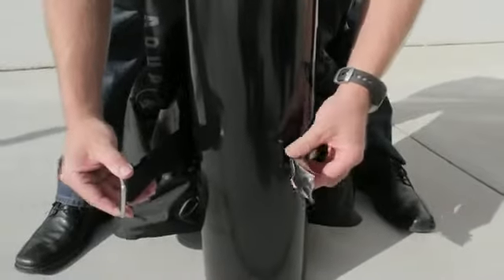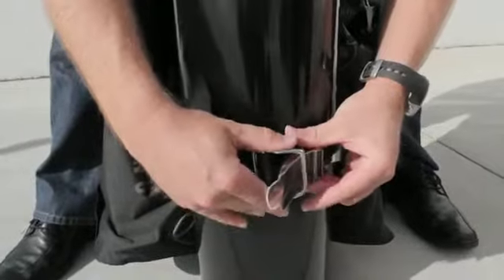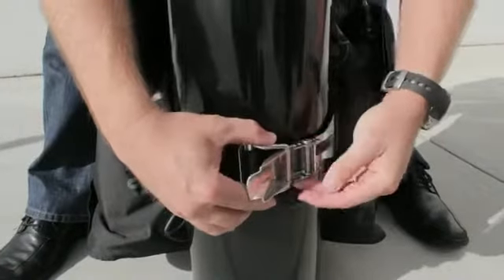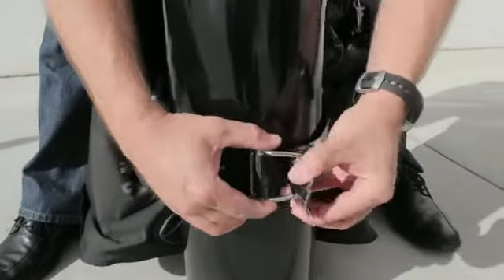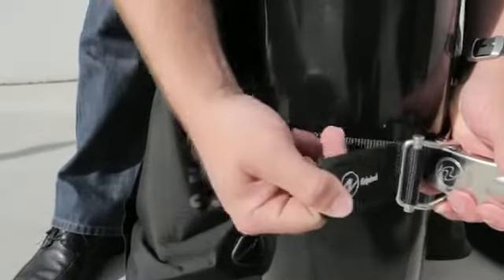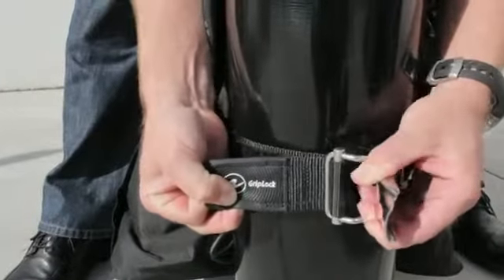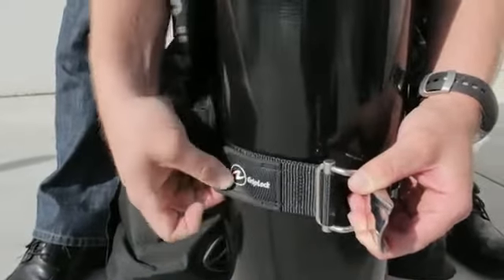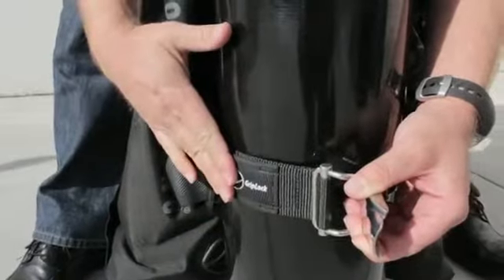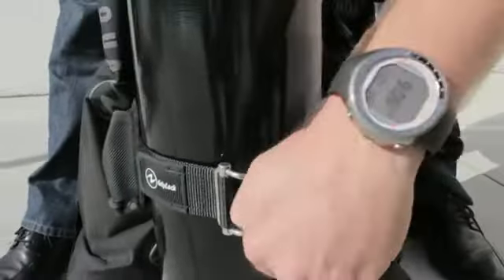Attaching a BC with Griplock to the cylinder is an easy process. It's just a matter of inserting the bail into the bail slot of the Griplock buckle. While holding the buckle stationary, last minute adjustments can be made with the micro adjuster. Here the band can be loosened or tightened accordingly. Secure the micro adjustment with the hook and loop and then pull on the Griplock buckle to cam it over and tighten it into place.